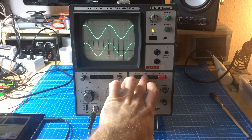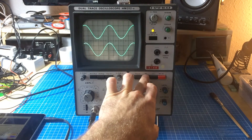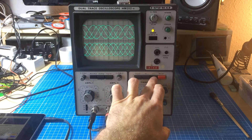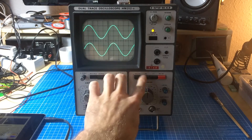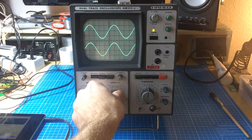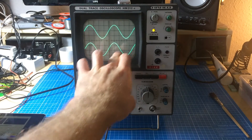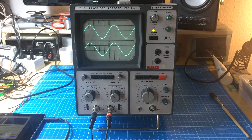If I pushed the TV button, that seems to be alright again. But if I push the buttons here, there's some ghostiness. It had the problem that on one channel I can't reproduce it now — Murphy's law — but there were like two sine waves visible. I think the problem is that the switches are dirty on this thing. So let's open this, see what's inside, and clean some switches.